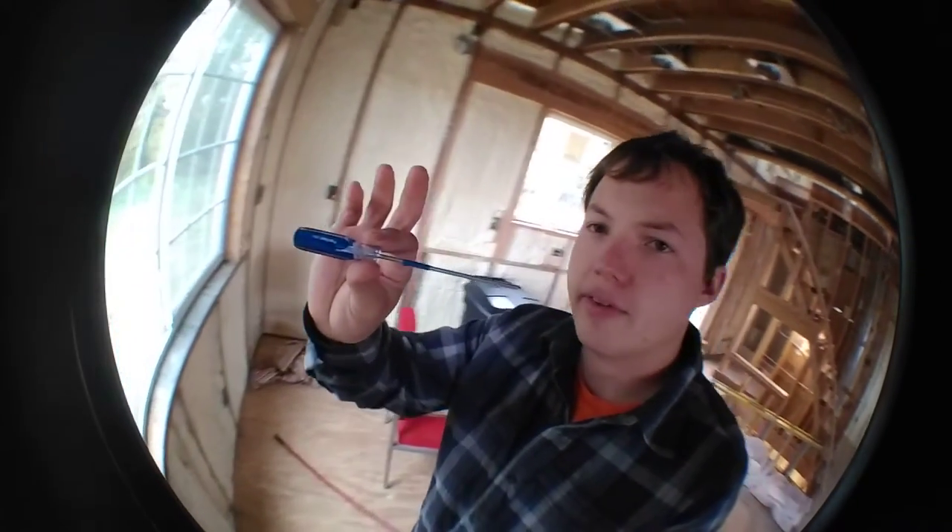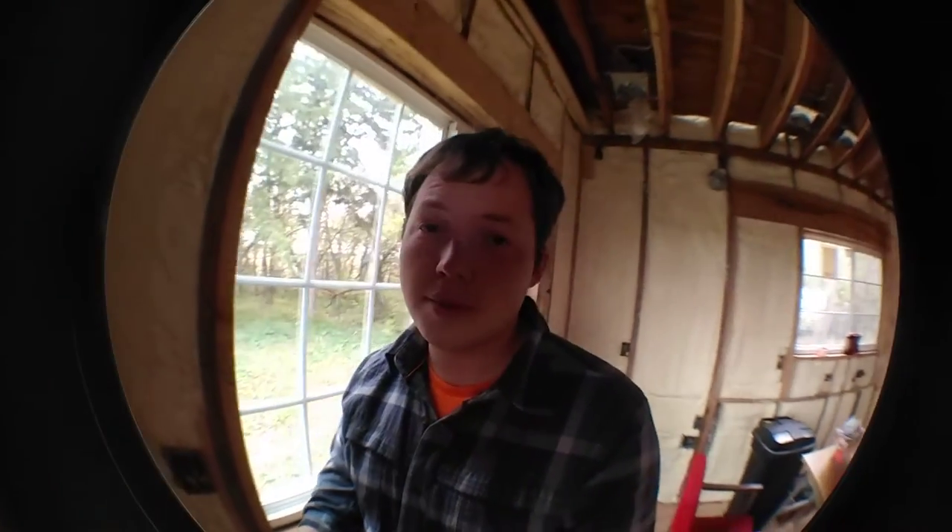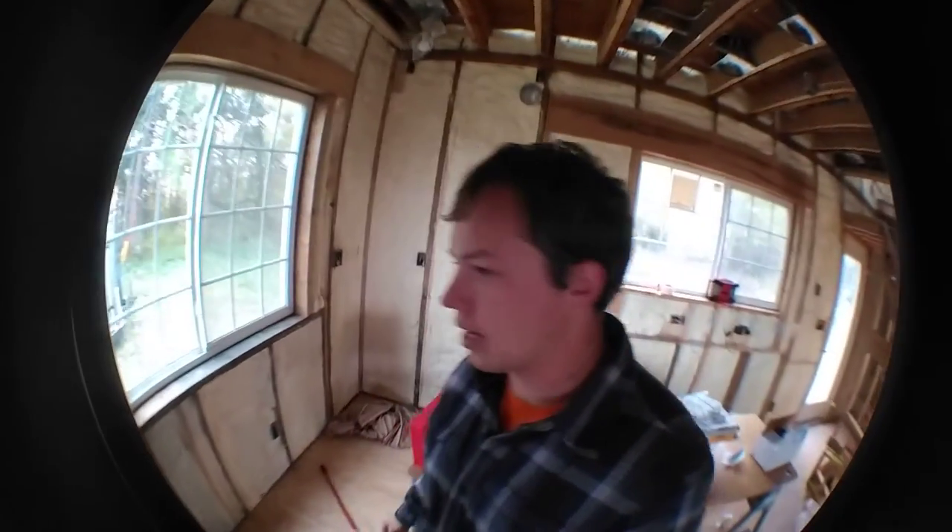The last item is really important and is probably the least fun part of the project — and it involves this screwdriver. An ordinary small screwdriver, or really any sharp object. I've got it measured at two and a half inches, which is the depth my spray foam is supposed to be — that's what the estimate was for, a two-and-a-half-inch average depth. You need to be aware of how much foam is actually going in. I talked to a few different spray foam companies and they said you should depth check, and if there are any low spots, they should be willing to come back and fix it — though they should be depth checking themselves.